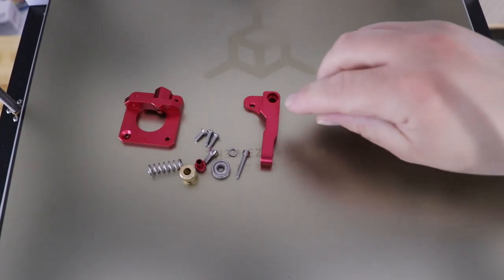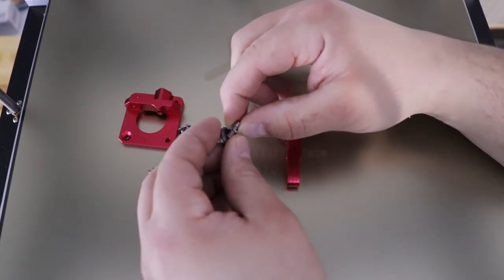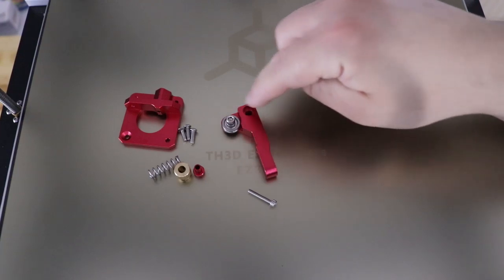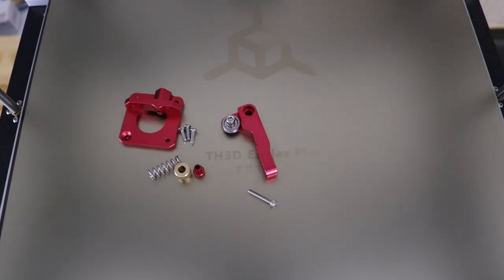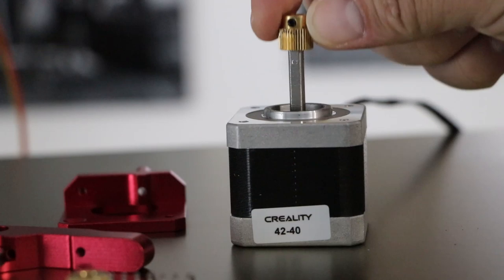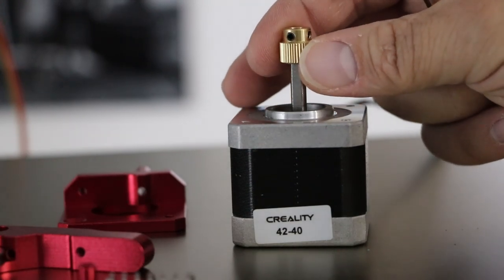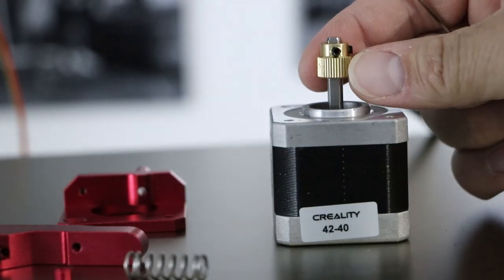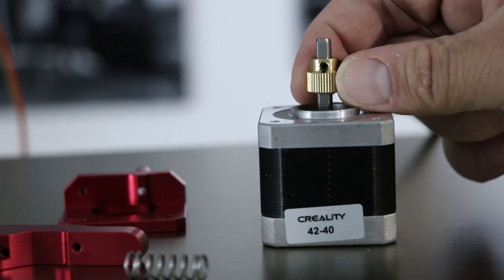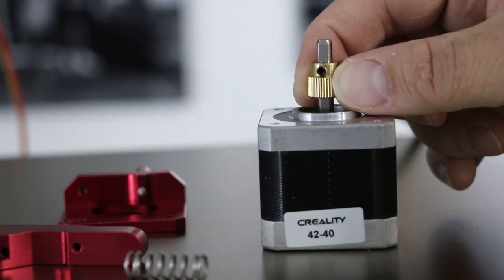First, put the pulley together: take your arm, put your lock washer on, the shorter capped screw, and your pulley, then screw that down into the arm with your Allen wrench and tighten it down. Next, swap out the gear: loosen the two grub screws, slide the old gear off, and slide the new gear on. The flat surface of the shaft is right here — loosen your two grub screws and slide it down about halfway, since we don't know exactly where we'll sit yet. Tighten them snug so it doesn't move, but we'll adjust again later.